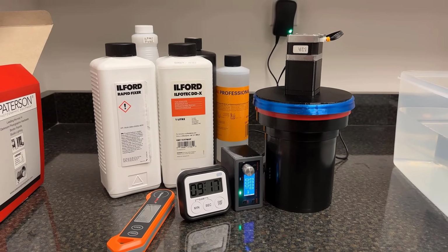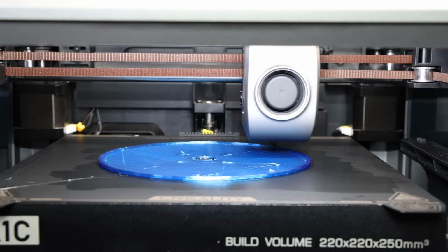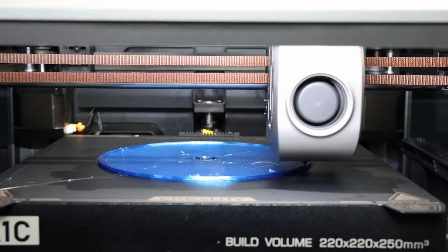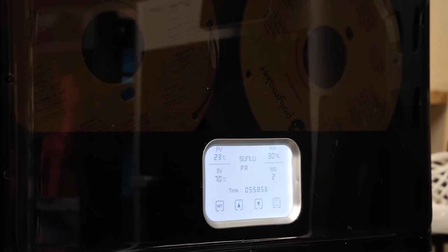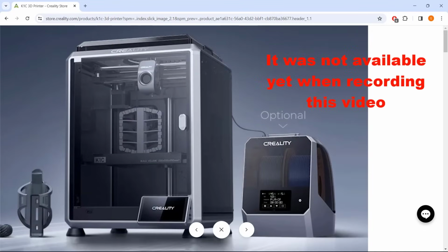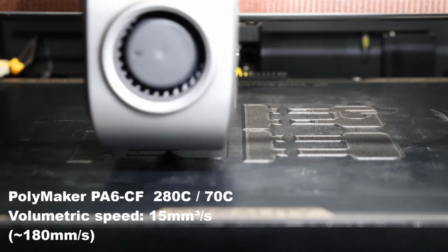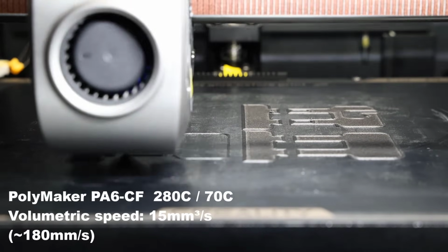While we were having fun with our project, we were actually drying some carbon fiber filament, as when printing the TPU lid, we saw the humidity was getting too high and starting to affect some moisture-sensitive filaments. So before we print nylon carbon fiber, we will dry it for 6 hours. I saw there was a filament dryer on the K1C page and it looked pretty nice. Okay, I will print some hanging clips with nylon carbon fiber. After the nylon is dried, it's pretty easy to print.